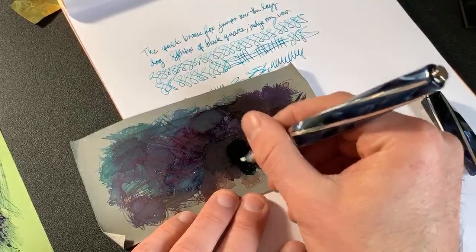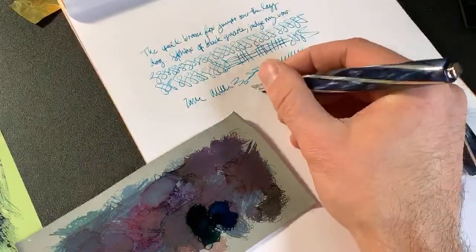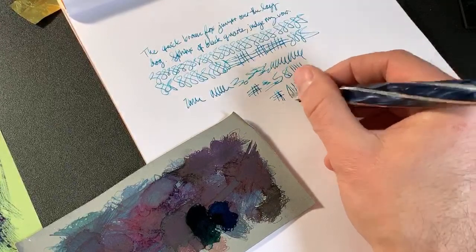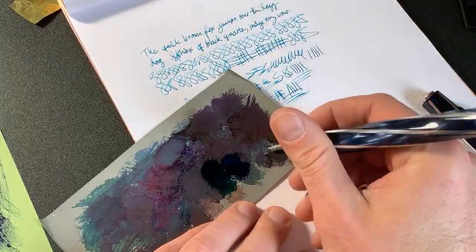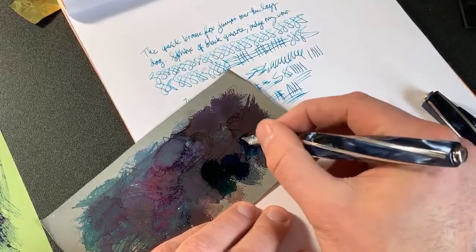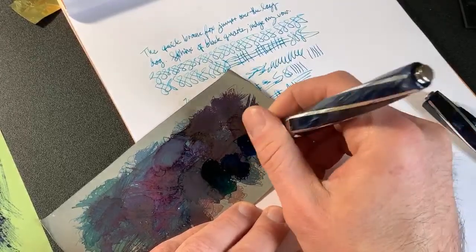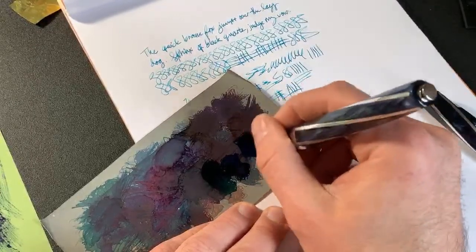Polishing it up requires an abrasive material to do so, so that's what we're doing right now, but you don't want to go too far. So it's a series of very small tested adjustments. I could feel that the downstroke is much smoother than it was before, but my side-to-side strokes, well, yeah, it still could just use some more. So I'm going to keep going at this. And once I feel that I've got decent smoothness, that I don't feel that hard, scritchy feeling anymore, then that's when I'll start to go to the Mylar paper.